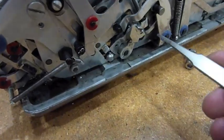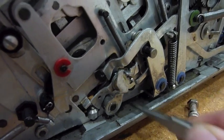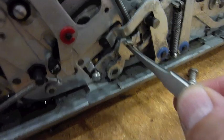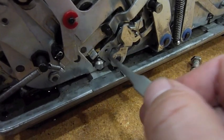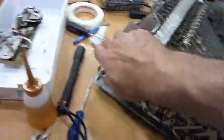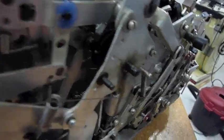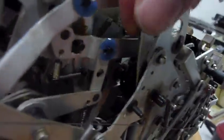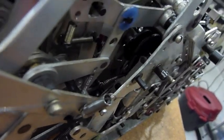It wasn't adding — I basically couldn't push the plus key in. I discovered it's this mechanism over here that didn't work too well. It was this guy — he wasn't returning; he was stuck. Now it's unstuck and I can push the key in to make addition and subtraction. I think it goes from one cycle — nothing could be wrong here, it's going to add. But when I multiply, it never engages the multiplier, and I think it's because this guy over here is stuck — that's the one that pushes the power cam.